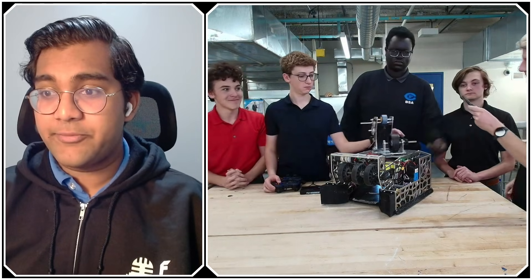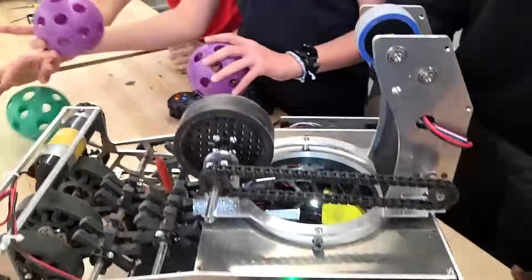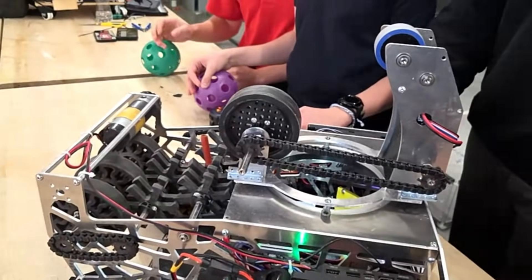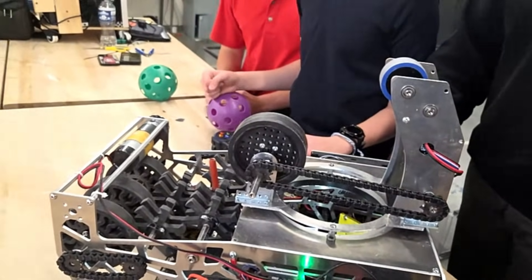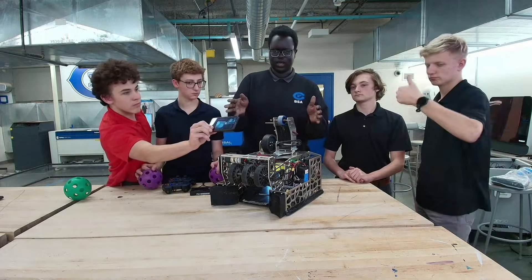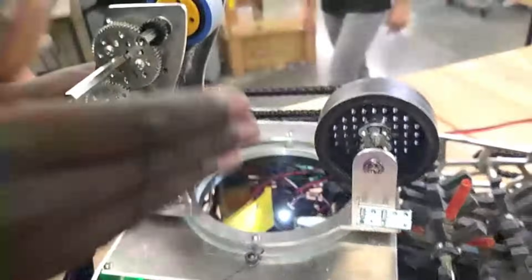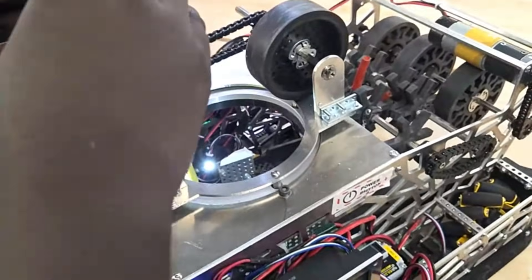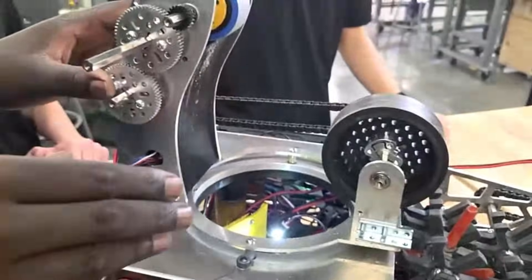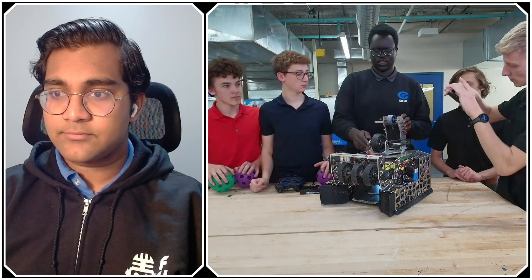Talking about the turret and the shooter as a whole — your shooter is very minimalistic. I haven't quite seen a team with so few or so small parts on their shooter. Why go for such a minimalist design? Our first shooter was very boxy and very wide, so it had a lot of weight and was very sluggish when turning. Our goal for the next shooter was to first have a counter roller and second, make it as light as possible. We cut down a lot of weight by removing the side panels and using tiny plates instead to mount our wheels and motors together.